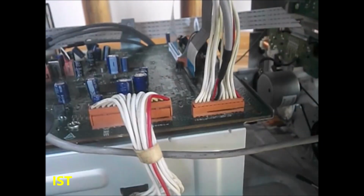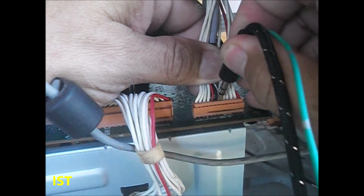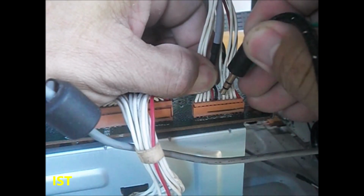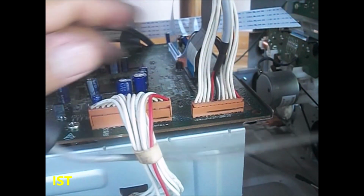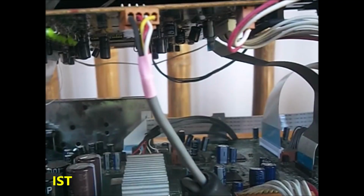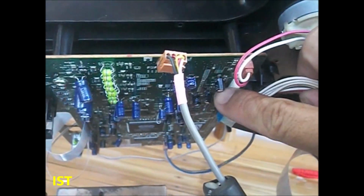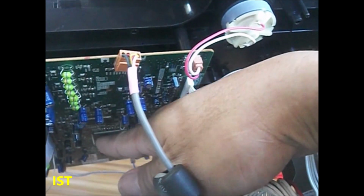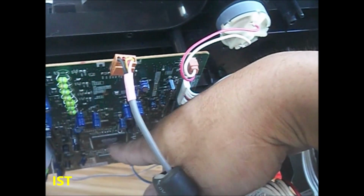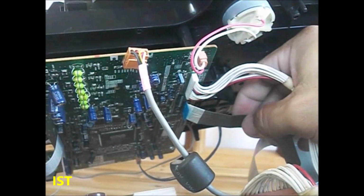Okay, so now let's trace the signal. If it goes here in this wire, okay, so the signal is here, and on the red wire also. But I'm mainly focusing on this one. So the signal is also there and going up here. There. So this wire is going up here and to the flat IC, which is the MCU also for the CD and the... So the signals are being combined here in this IC, the MCU, and go out to this wire.